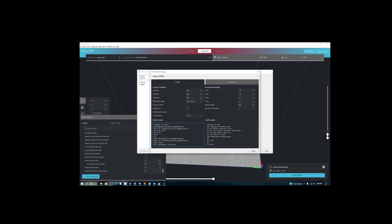First thing it's going to do when starting a print is get to the temperature. These are G-code commands to wait until your bed and your nozzle are up to temperature. This is important because your bed can warp and go different shapes whenever it's not fully heated up.